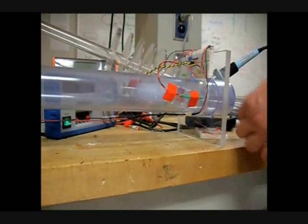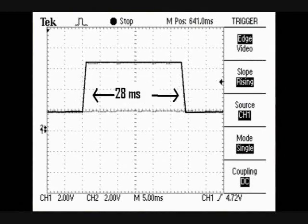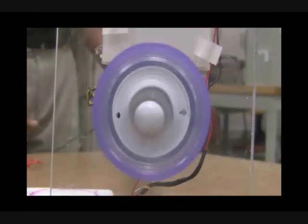When the ball is released, it passes through the first interrupter, creating a pulse that can be viewed on the oscilloscope. The same thing then happens on the other end. This allows us to view the elapsed time for the ball to travel the distance, from which we can calculate the golf ball's velocity. This is a simple demo that illustrates the principles of an opto-interrupter.